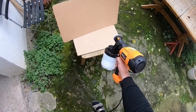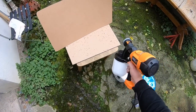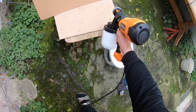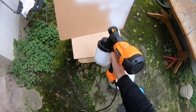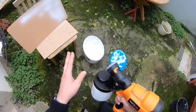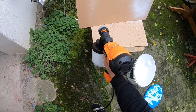If you assemble the thinner spray tip or the thinner nozzles, you can begin. For example, use the spray tip and a nozzle with 1 millimeter. It is for sealers, stains, enamels and varnish. The recommended viscosity is 30 DIN. The projects, for example, are tables, chairs, bicycles, shutters, cabinets, wooden toys and models.